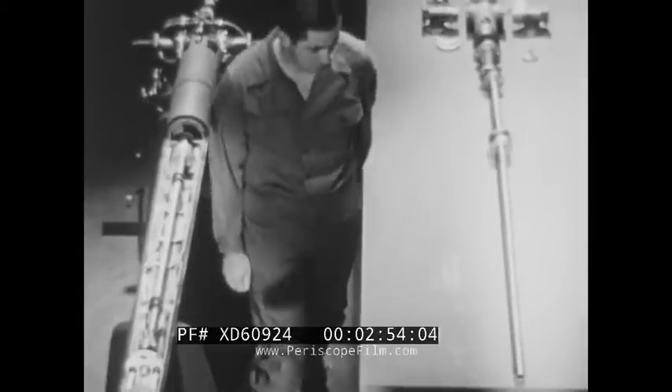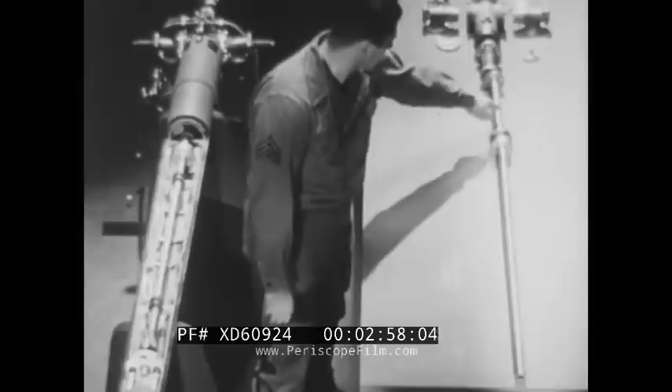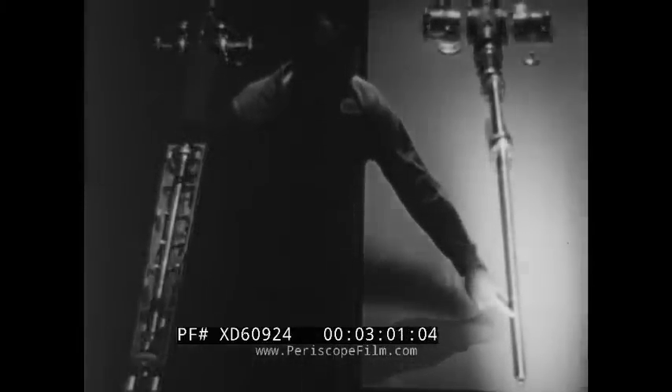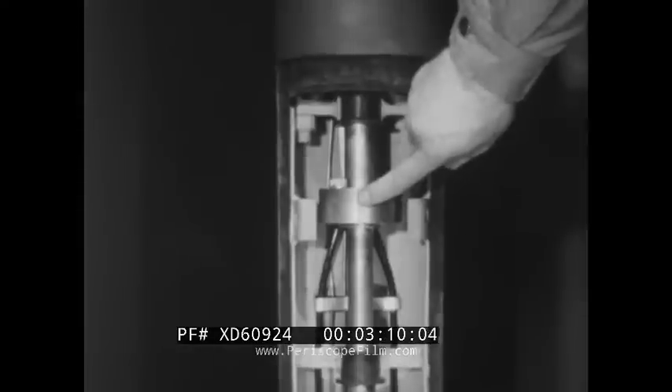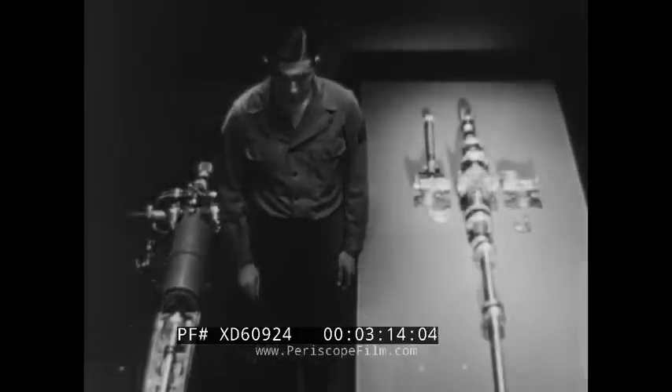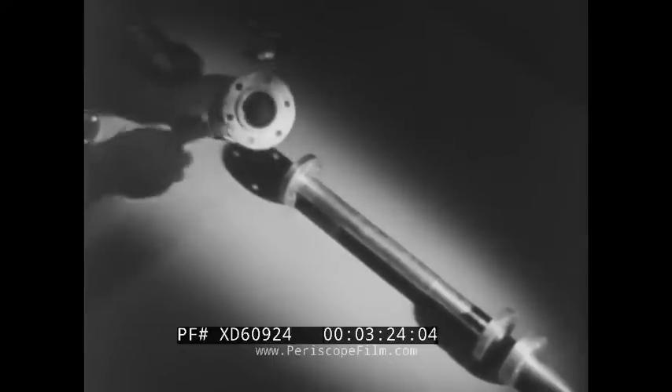Here we see what the gun looks like disassembled. Notice that the nozzle is in three sections. The flange connection to the long extension is far enough forward to make field replacement easy. Back of this is a shorter section, then the tapered section — in this, the fuel rod is reduced from two inches to three-quarters of an inch.